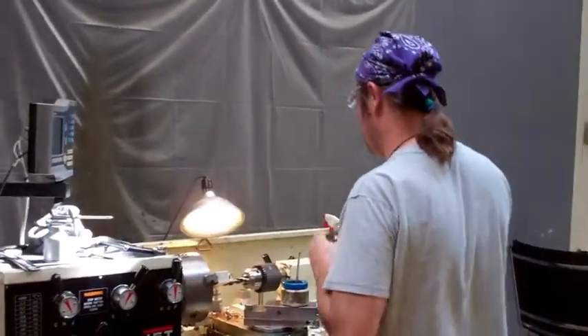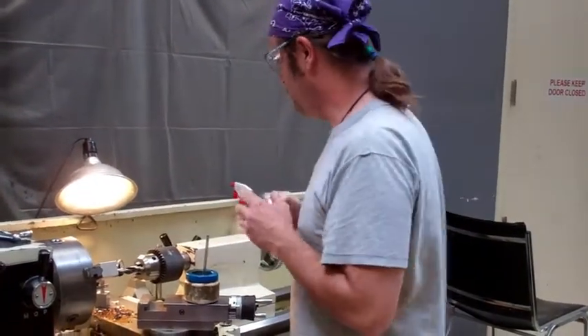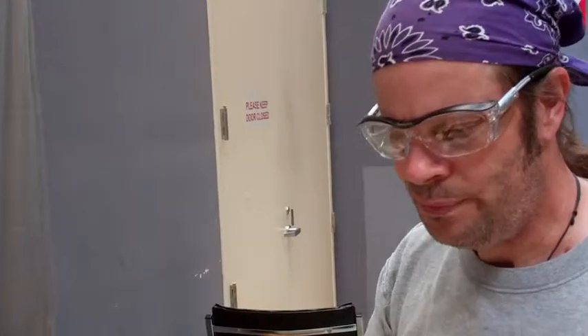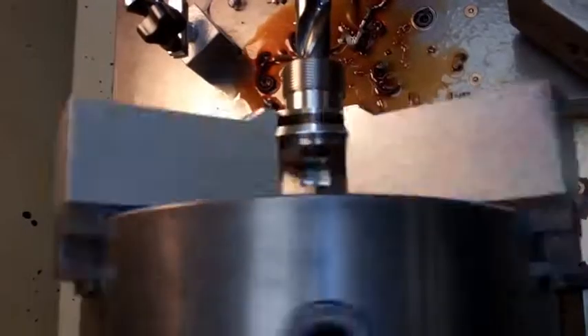The fact that I stopped at ten was nice — I still have ten thousandths more to go. Now I can drill it without worrying that I'll drill too far. On a regular chuck with standard steel jaws, if I took the part out and put it back in, it wouldn't be concentric even to itself. This allows me to take the part out, measure it, and accurately determine what the final depth will be. So when I hit the bottom of the hole, I'm also going to make sure I come back up to ten — that's ten thousandths more to go. Now I drill and hold.